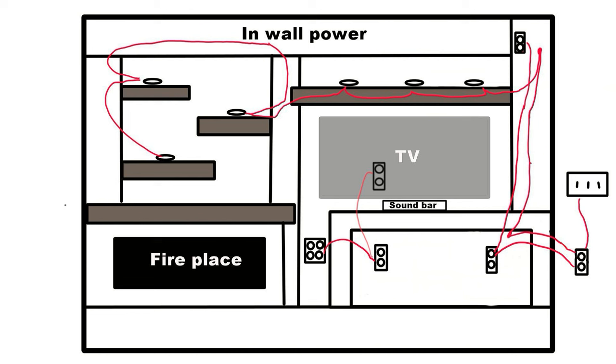That meant I was able to control my new lights in the shelves with the switch on the wall. The bottom part of that same outlet also gave power to the outlet in the cabinet and up high to the router — not controlled by the switch. Make sure you run an outlet behind the TV. My speaker did not require power so I didn't need to run power to it, but yours might.